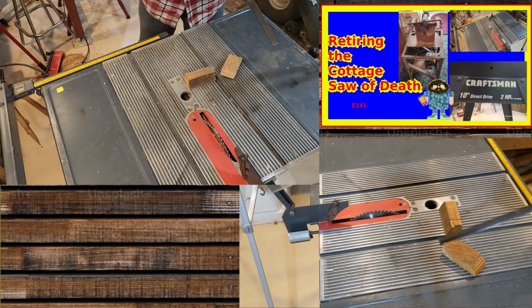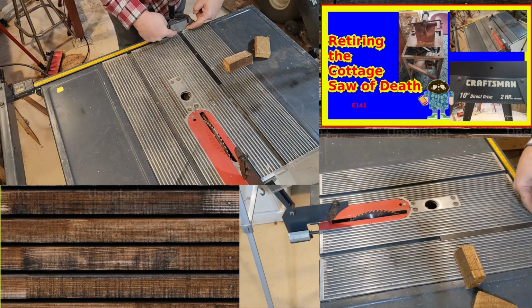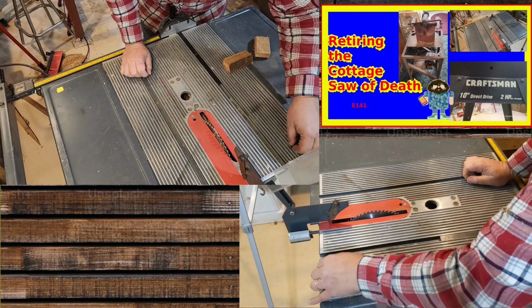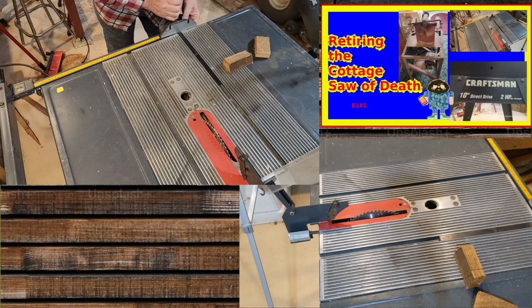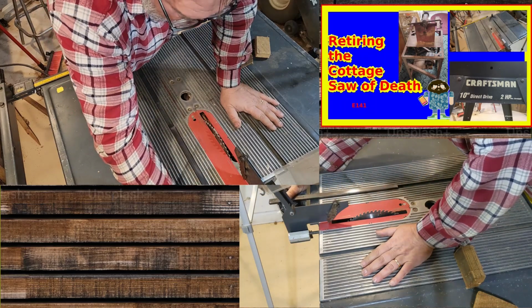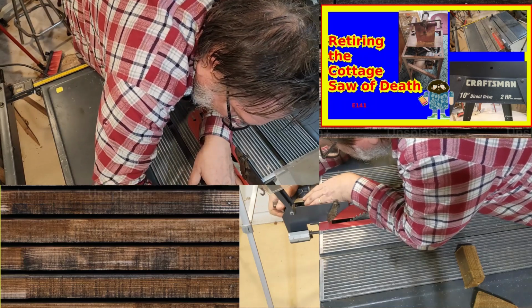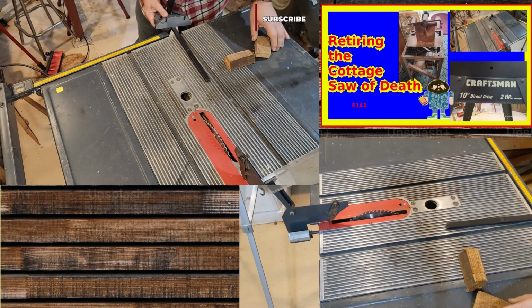And for the crosscut, you want to try to make sure it's square as well, right? A good way is to take it over here and look at the edge of how it lines up with the table, and it's not. So let's adjust that. Some tables, maybe on this one, you take it and put it upside down. Well, that's pretty close. See how I did that? You put it upside down against the table, and you can check if it's good or not.